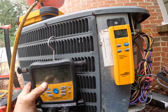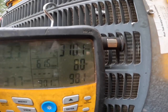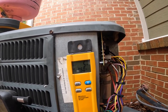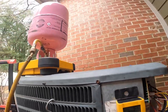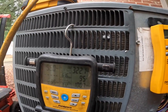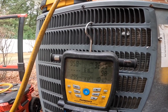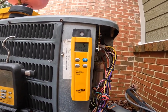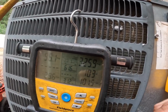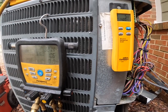It is running in heat. It's 76 degrees inside. See my head pressure and my subcooling. I'm getting close to my 5 pounds, 14 ounces. And it sounds like I'm about to empty that drum. Subcooling at about 10 degrees. I am dead on the money on the weight in charge. That is a good pressure for 76 degrees inside. And you hear my compressor's not clicking anymore.